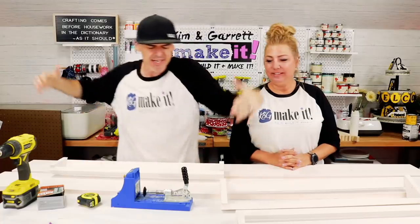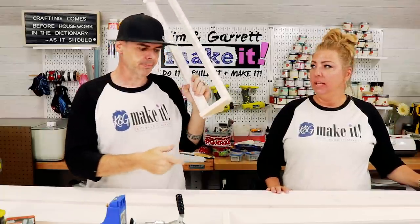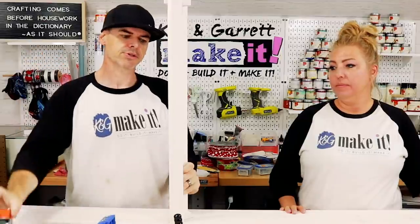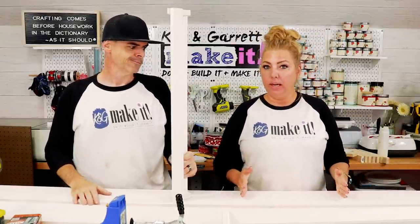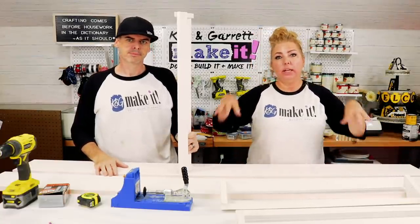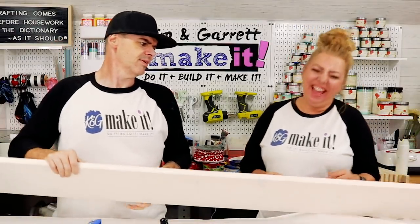Step six: now we're going to assemble the sides. We have our shelves and our one-by-eight sides. We're going to start by putting a pocket hole in the bottom and then attaching these with one-and-a-quarter-inch screws every one foot up — technically from top to top it's one foot, but between them it's nine and a half inches. The pocket holes are so we can attach the sides straight to the dolly. We have to do it on its side because it's too tall.